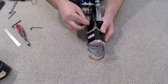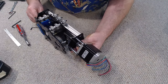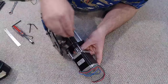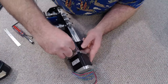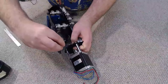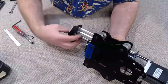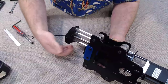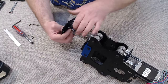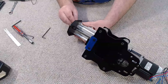I left the plate loose so I'm going to push the lead screw into the Z coupler, then tighten up the coupler. With that coupler tight, I'll slide in the bearing and then slide the locking collar up to the bearing and tighten it. The bearing sits down in the recess and the locking collar sits in front of it. We want a bit of tension on this axis — we don't want slop because that will produce really poor cuts. Don't forget to tighten the cap screws at both ends since we left them loose for adjustment.